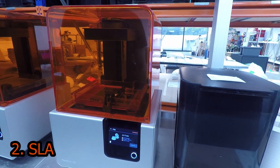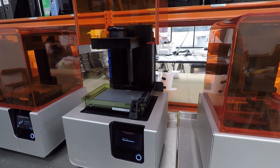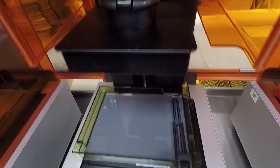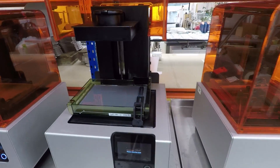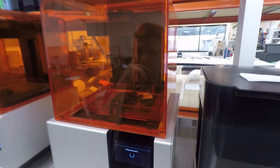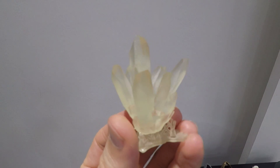The next type of printing is stereolithography, or SLA, which is a resin bath that is cured by a light. The technical term is photopolymerization — basically the Hollywood version of how the Terminator T-1000 liquid metal guy was made. The light hardens specific points in the resin liquid and then prints the next layer. This technology has come down in price to around $2,000 for a machine. These are great for very high detail and the translucent resin can give a wonderful look. They're limited by a much smaller build area, and may still require support branches to hold the part together during printing.